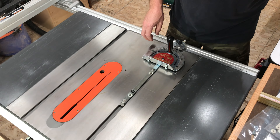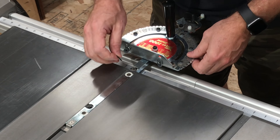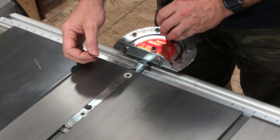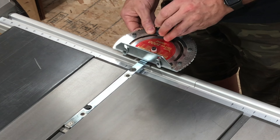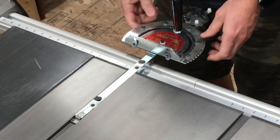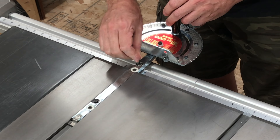Then we'll move it over to the right slot. You have this tiny little Allen wrench to adjust these discs. The white ones are plastic that smash down to make the bar wider, and the black ones are more rigid. You can totally remove the black ones, which it looks like I might need to do, because it seems to be what's interfering with sliding well in my miter slot. I'm going to loosen up the white ones and see what happens. Yeah, we're hitting the black one, so I'm going to take that out.